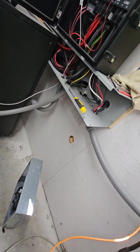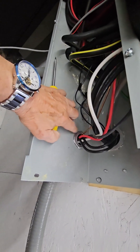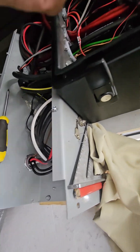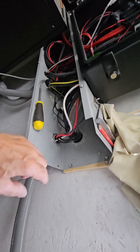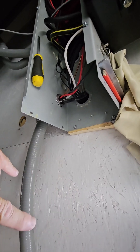It is getting hot and I've got all the fans running, the air conditioner running, and it's still hot in there, so I've got to get busy. I need to shut the grid off to get this thing wired in. This is the grid that goes over to the 6K. I need to move it out of the way so I can drill a bigger hole to mount this guy, then route the grid wires in and back up to the inverter and over to this inverter. When I turn off the grid, this building is going to go dark except for the 6K at the other end of these wires. I can use the grid for about an hour, charge the batteries up, and that will give me lights and air conditioning for an hour while I work.